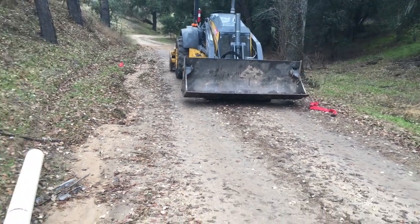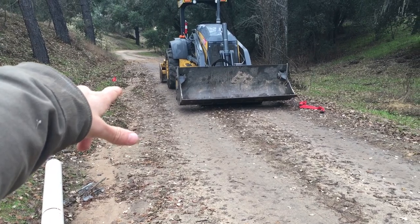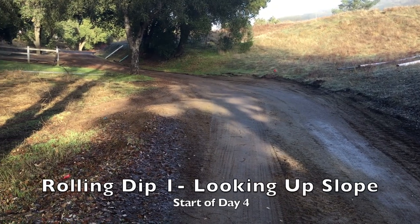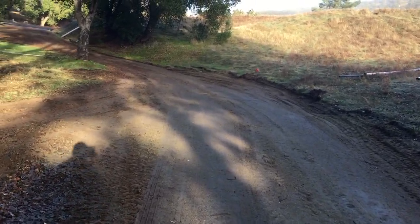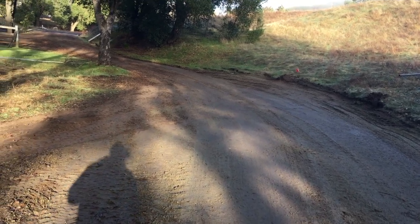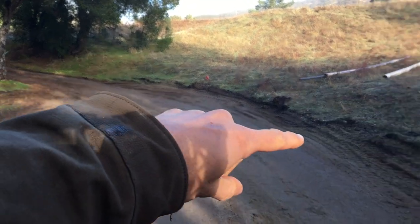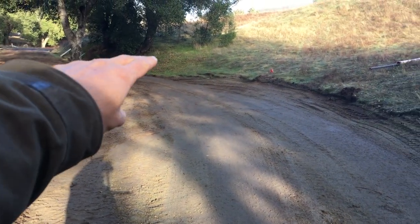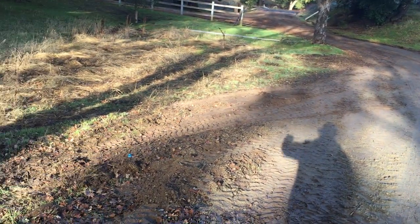The plan is to bring in material from here on down to create the rollout for the dip, finishing somewhere around that red flag. Here we are at the start of Day 4 — Rolling Dip 1 has been completed, finished the previous morning. Even though it looks like nothing in front of the camera right now, water was initially just running around and staying on the roadway, continuing down to the culvert beyond. Now there's a dip, so water will follow this course and come off right through here in this lead-out, right into the nice flat wide valley bottom.